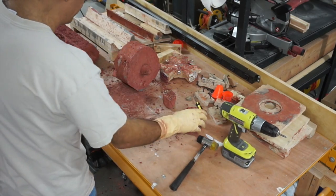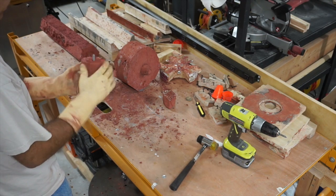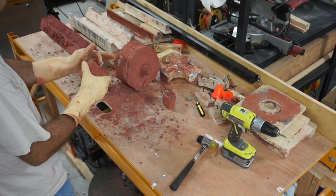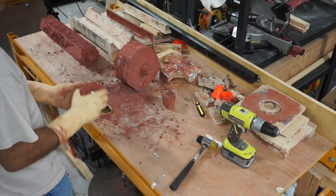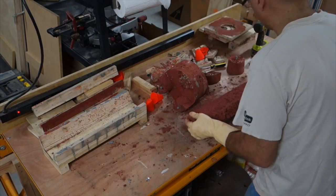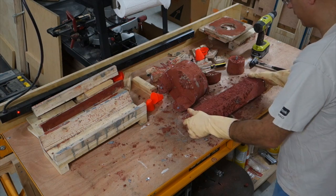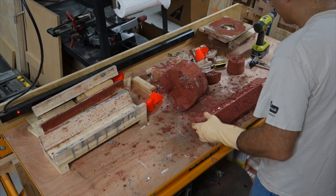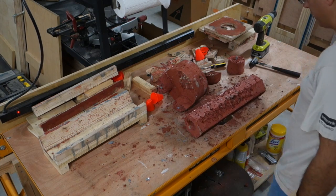And then this piece, this casted pretty good, actually. Not bad. It didn't quite fill out here, but the screw came in pretty straight, which I'm glad about. So that piece is not bad looking. This is the big disappointment. Apparently I really did a terrible job of mixing that material. It's the same material, but for some reason, when I filled this part in, it casted really bad.